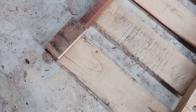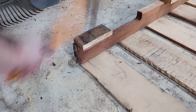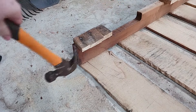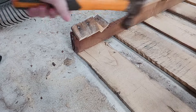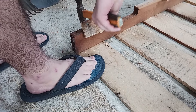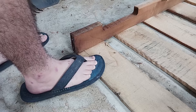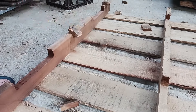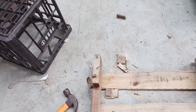All our boards are there. You might be asking yourself what to do with these end pieces that are left. What I usually like to do is get the hammer and smash them out — just like that. Sometimes the nail won't come, sometimes it will. Just go along repeating that. Here for example the nails didn't come out so I'm going to have to pull them out later, but that's not too bad.